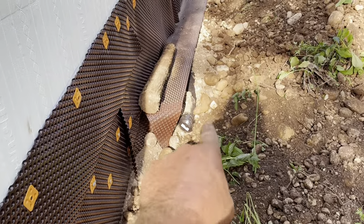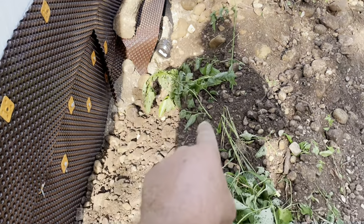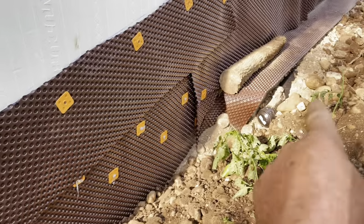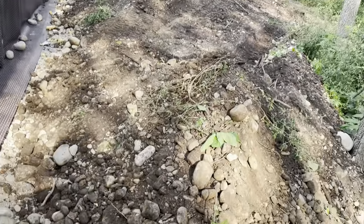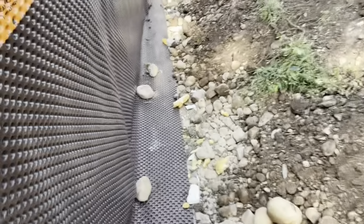So right there is our foundation drain. So I need to shovel some of this dirt. I just put it here, level, and then I'll put a solid pipe, hook onto the foundation drain, and drain it to daylight. We call it right out here. So that's what I'll do tomorrow morning. So I don't think it shows up on camera, some of these elevations here. We got the Delta roll on. That's a huge accomplishment.